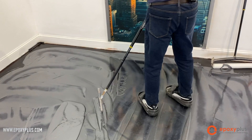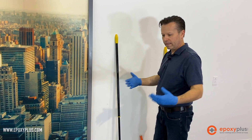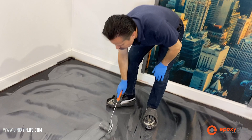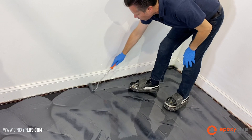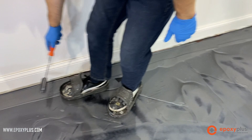I've left a little puddle of product there purposely because I'm ready now to start rolling the epoxy. These roller covers, whether the 4-inch or the 18-inch, really soak up a lot of product. So I leave a little puddle to get my roller really saturated before I start to roll. Then I can come in here and start moving it right up to the wall, using material close to the wall to fill in the gap between the field of the floor and the wall.